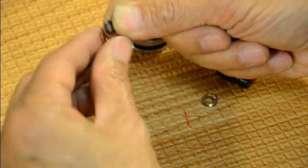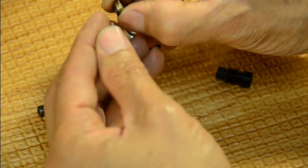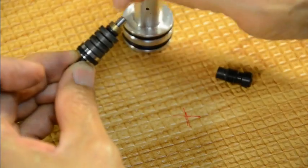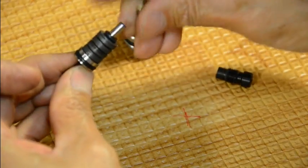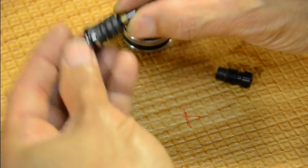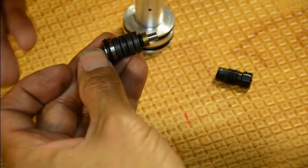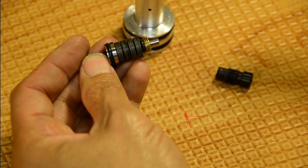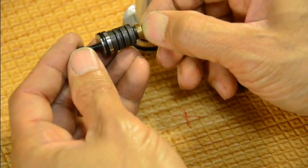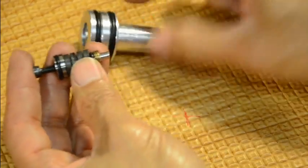What holds this o-ring in place is a brass nut over the shaft — it seals both the OD and the ID of the rotor and keeps it sealed. If the seal fails, you get unregulated pressure on the other side — it's like a straight-through pressure and the regulator is practically useless.